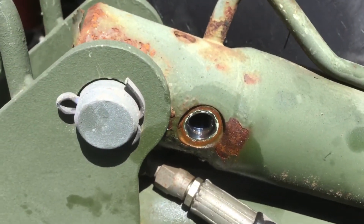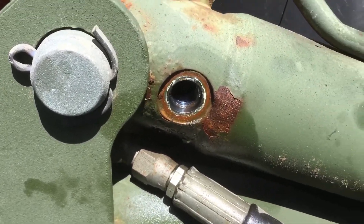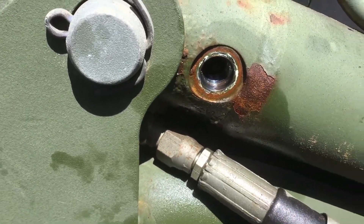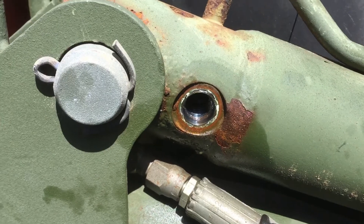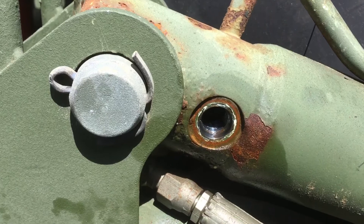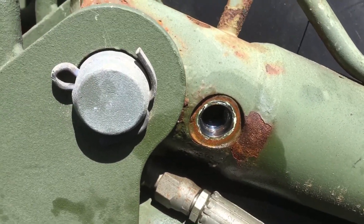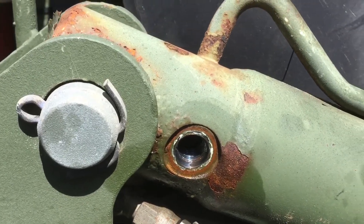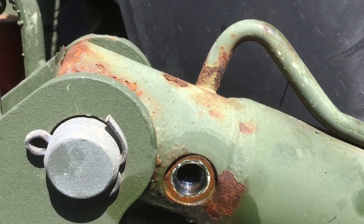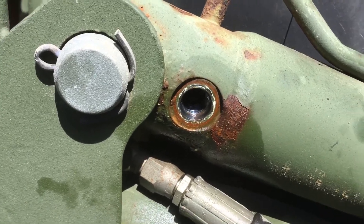That is how the safety checks go together. I do not know if it is possible to get that valve seat and ball and the other innermost spring out of there. It looks like it might be something that was put in with a helicoil tool and screwed up in there. I do not see any way to get a bite on it to unscrew it back out of the port. There is no screw head on it, no slots for a standard screwdriver. I am not sure exactly how it was put in there, but I do not think it was ever intended to come back out.